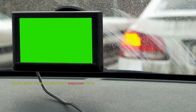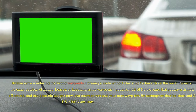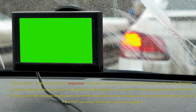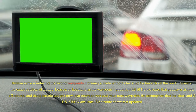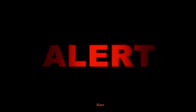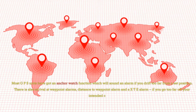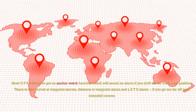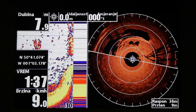Issues with GPS: human error — entering the wrong waypoints, forming a route without checking for hazards on the track, entering the exact position of a buoy, beacon, or headland as the waypoint (you might hit it), not noticing that you have drifted off course and that possible danger now lies between you and your next waypoint, an assumption that the chart and GPS is 100% accurate, and electronic charts not being updated. Alarms: most GPS units have an anchor watch function which will sound an alarm if you drift too far from a set position. There is also arrival at waypoint alarms, distance to waypoint alarm, and an XTE alarm if you go too far off your intended course.